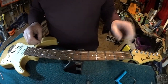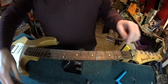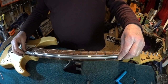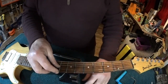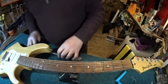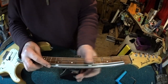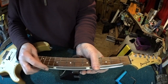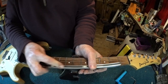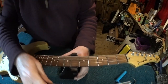And if we do get rid of the wear grooves down here, then we're sort of lucky. It's an added bonus, but it's not our primary target. So I'm setting this up, happens to be just set right anyway for starting on here. So I'm going to kick straight off with leveling the E track. And meanwhile, I'm going to be thinking to myself where I'm going to get short grub screws from. You can buy sets of them. Obviously they would be an additional cost, but more importantly, they would take a few days to arrive, and something like £6 for a set.